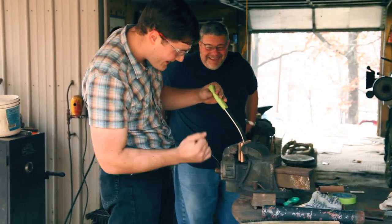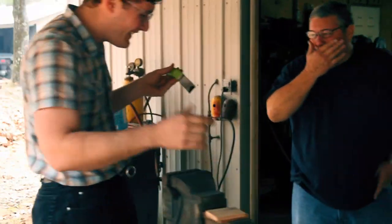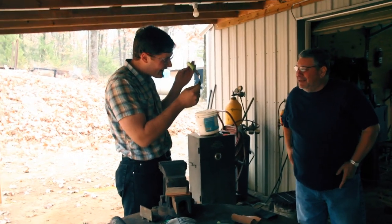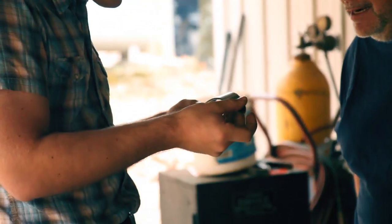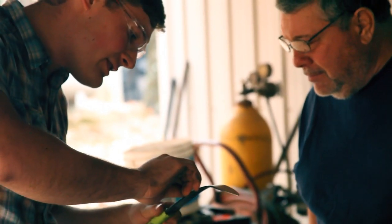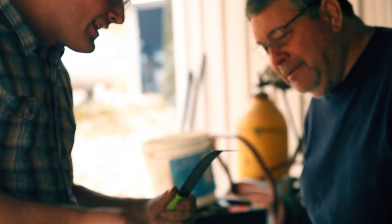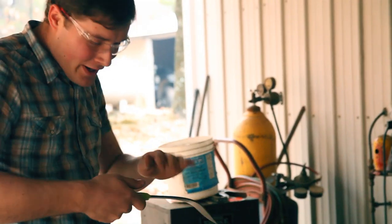Oh, yeehaw, it's over. Oh yeah. Didn't it did any better. It didn't even crack, did it? No, it didn't bend back at all either. I heated the edge with the torch, and I only edge quenched. You see that hardening line right there? So all this is dead soft. Yeah, that's good. Woo! Did a good job.